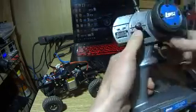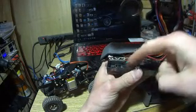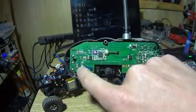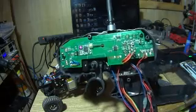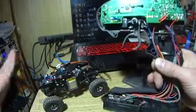Here's the switch that I'll actually use for shifting. So there's the Arduino, and it's all wired up with these pins so you can plug in whatever you want. I have the first two analog pins wired into the stock locations for the pots — so this would be the throttle, and then you have your steering pot right here. I wired those both in so that the Arduino is reading both of those signals, and I can create basically a fully functional Arduino controller with speed control and whatnot.